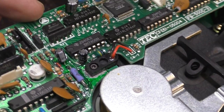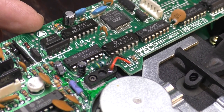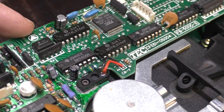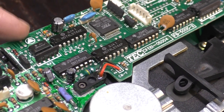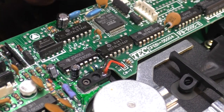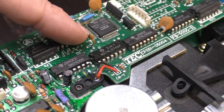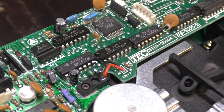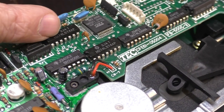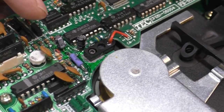I've had this board off of here about three more times. I found some schematics, the ones from Ray, and also found out that the TRS-80 Model 100 DVI disk video interface uses the same drive. The service manual for that had a layout of the board. The quality of the scan wasn't great, but it was good enough that I could check all the lines into these two chips where the worst of the corrosion was. That was fine. I did find I had missed one broken trace under this chip, which I fixed. It still wasn't working. So I checked everything again and again.